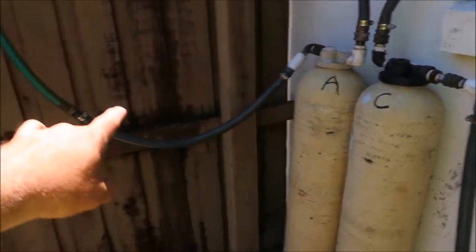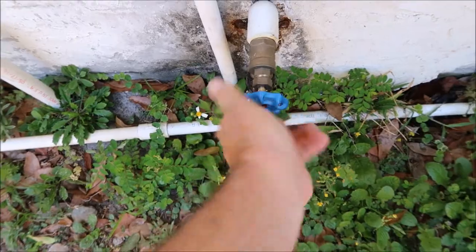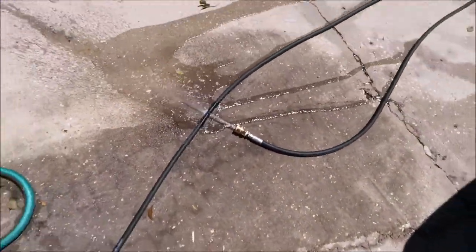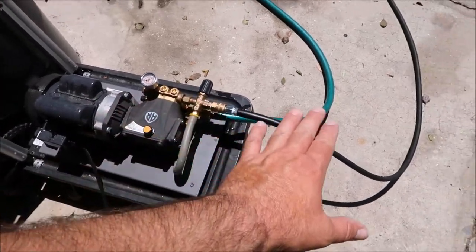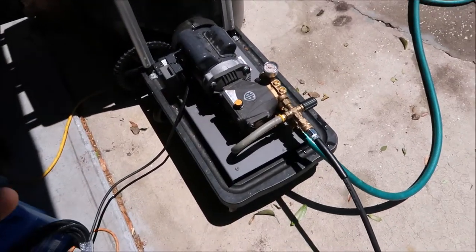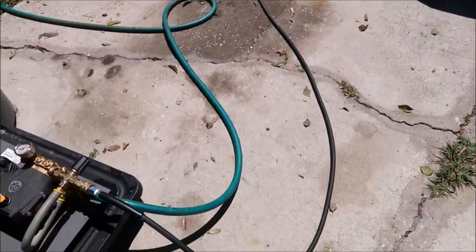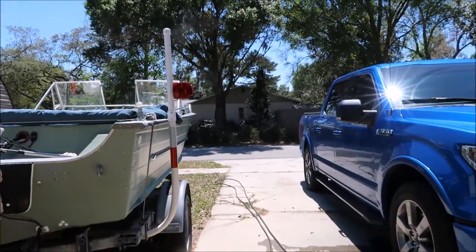I've got my tap water going in, through my DI tanks from tank to tank, got my hose on that. What I want to do now is open up the valve and get some water going in there while that end is open. Let it run for a minute and get all the air out of the system - from the hose to the unit, the pump, everything. You want to get all that air out. This is only if you're disconnecting and reconnecting. If you leave the hoses charged while it's in your mobile vehicle, you don't have to worry about any kind of air issue in the line.